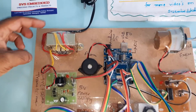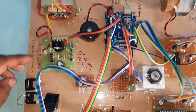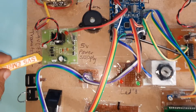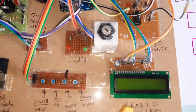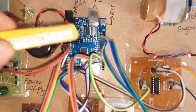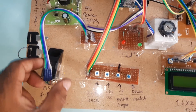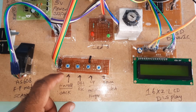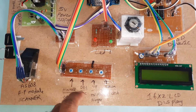In the hardware, we use a 230V input step-down transformer with 9V AC output, a bridge rectifier, filter capacitor, 7805 voltage regulator, and an LED to produce a 5V power supply module. The Arduino Uno R3 board drives a 16x2 LCD character display showing whatever process is running on the controller. The AS608 fingerprint module is included along with enroll, delete, up, and down buttons.